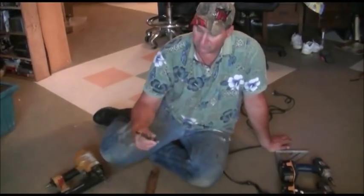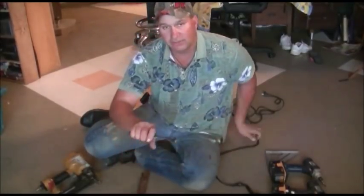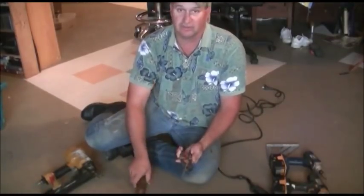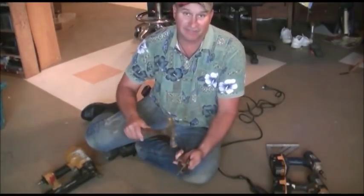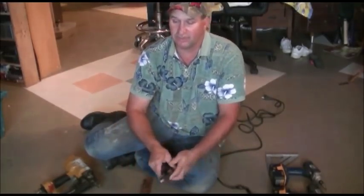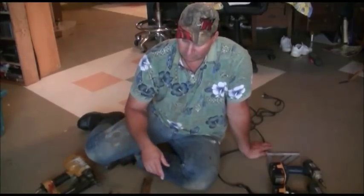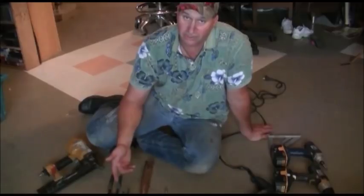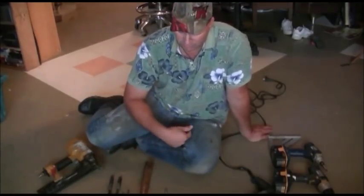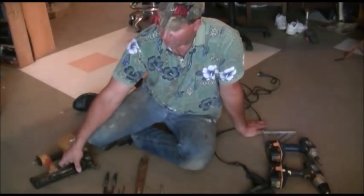If you have a comfortable position, you might be able to take a pair of pliers and literally hold the nail with the pliers instead of with your fingers, so if you miss, you hit the pliers. Something that I'd suggest, especially if you don't have a lot of experience. But anyway, there are some positions where you're not going to be able to hold it very well with that and the wood. Then there are also options such as air nailing.